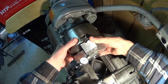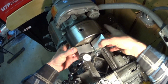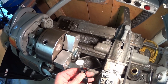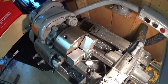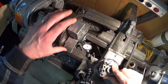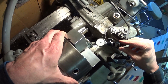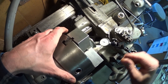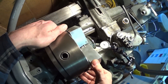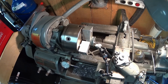There's about one thou low there. Not quite one on the sprocket teeth. And inside there — I don't know if you can see that — there should be none because I just turned it, but it's pretty good, about a half. So that's about as good as I can do as far as making these little sprockets run true.